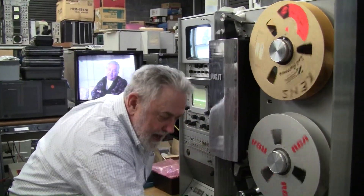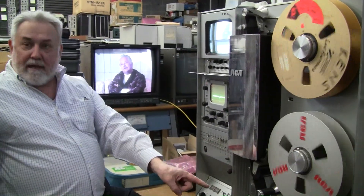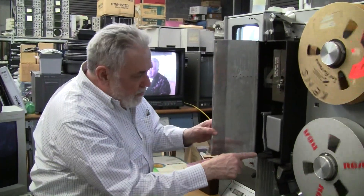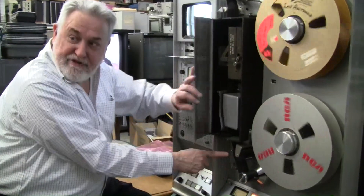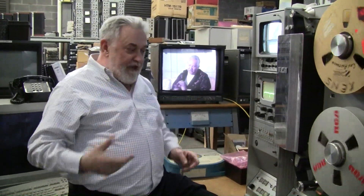There's also a thing called line lock. So if you've got a tape that's got trouble with the control track, you throw it in line lock — it'll lock the picture horizontally, but it'll ignore any disturbances vertically. What'll happen is the machine takes quite a while, because you've got this huge quarter-horsepower motor sitting behind this shaft here. You get vertical disturbance — all that inertia, that motor has to catch up with where the video should be, moving the tape faster or slower. And it could take five or six seconds before the thing's reframed again.